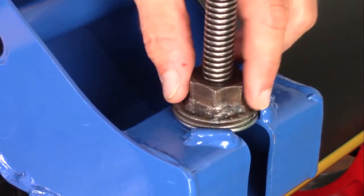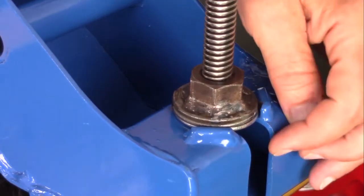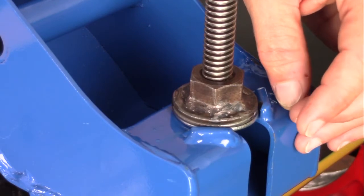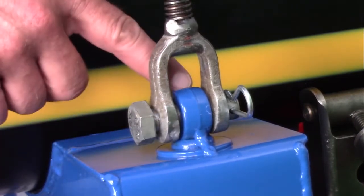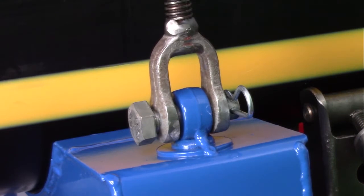These detents keep this in place, even under high torque. This receiving trough allows the swing arm to swing in and out quickly, making assembly and disassembly super easy. Down here, the eyelet that holds that swing arm on has been welded in place in order to keep this lined up with that trough above, again making assembly and disassembly very easy.